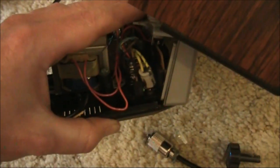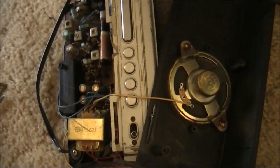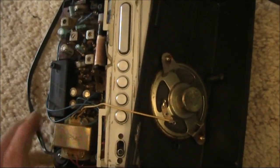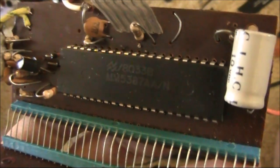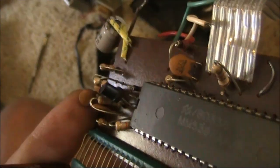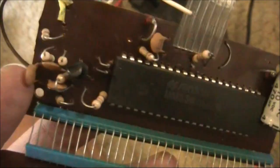With a cheap case like this, unlikely to be put back properly, the only thing that remains is to pull the thing apart and salvage any useful parts. Frankly, that's a bit of a relief - you don't have to be so careful, and you can just bash things around until the bits fall out. Just looking at the big IC in the clock section, it looks like it's a National Semiconductors part starting with 80, so late 70s was pretty close. The main salvageable parts here are the 10nF disc ceramic capacitors - a common value, but I'm always running out.